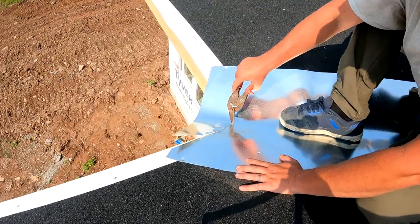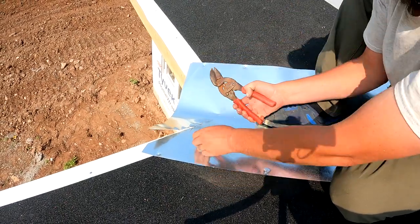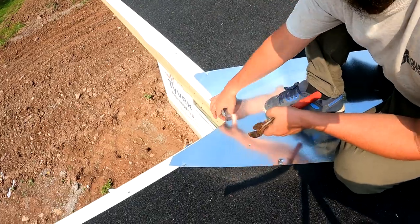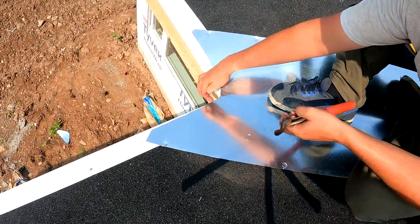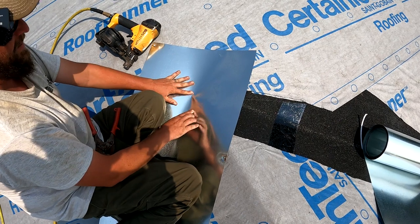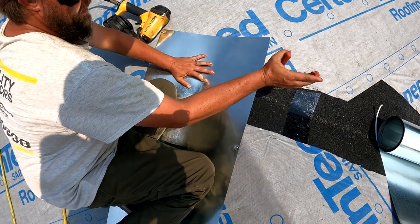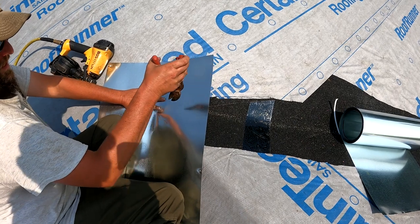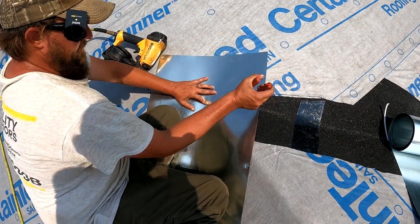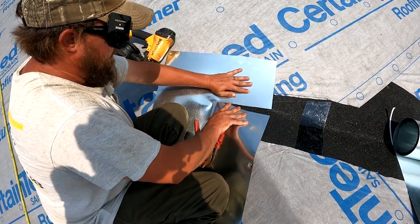Now when I get close to the corner I kind of round this off so that when water comes down it doesn't end up hitting right in that corner. There you can see how that looks — this is sticking out about an inch just right in that little tiny zone. Now at the top we have all this overhang here. You can see where the ridge dives into this roof. I take it and I'm going to cut it basically on that same line as the valley right to this point, and then this is going to fold over.